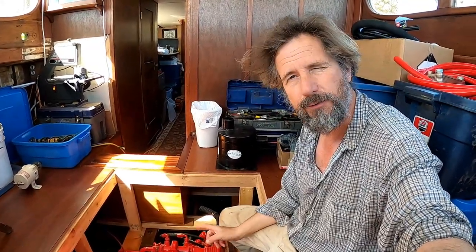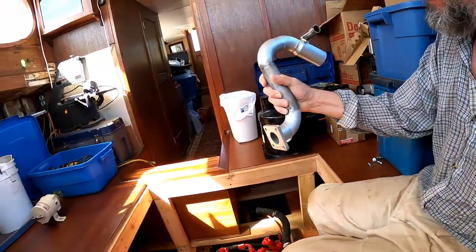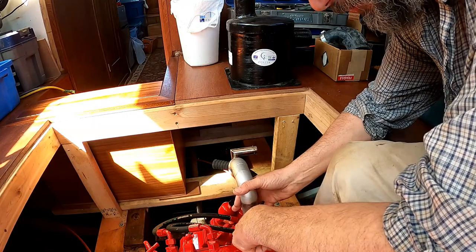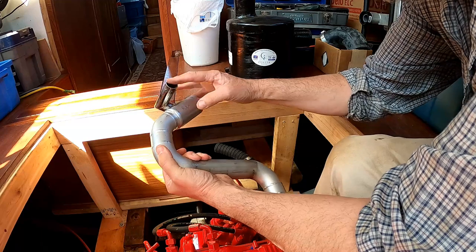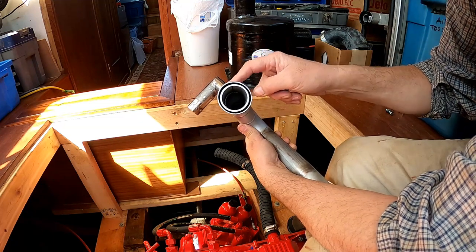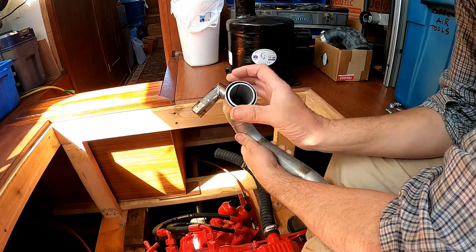The final system is exhaust — by far the most complex because it goes from here all the way to the back of the boat through a few loops and bends. The exhaust comes out the back of the heat exchanger at the exhaust manifold. This is the exhaust elbow — it bolts to the back of the manifold. This is hot dry exhaust, but at this point the cooling water coming out of the back of the engine enters. This is a Siamese pipe: the inner pipe is the exhaust pipe; the outer pipe begins at this point and is filled with raw cooling water, which enters as a spray all around the outside. That cools the exhaust significantly in the next few inches, and from this point on it can be two-inch rubber hose traveling backwards.